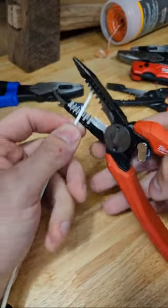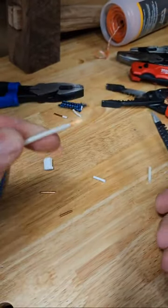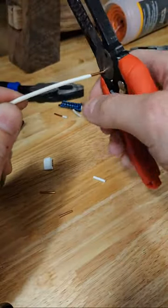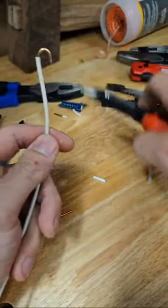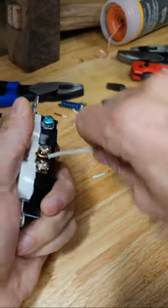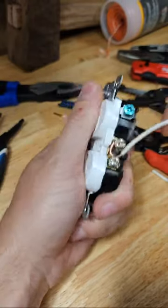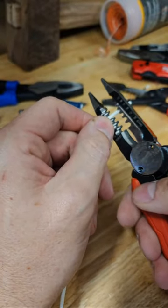Let's look at loops, because that's important. We find the 12, strip it. These don't really have loops — this is for cutting threaded screws. You can kind of loop with it but it's not really a loop. When you use these, you wind up with less straight copper, and when you wrap around the screw your insulation has a higher chance of making contact on that screw — and then you're in a world of trouble. What we prefer is to use the needle nose.